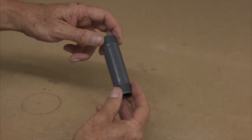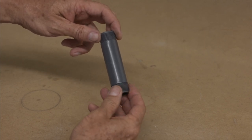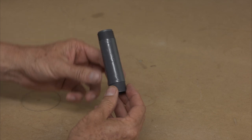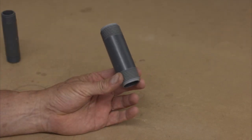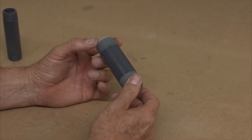On molded fittings and nipples, there can be variation in the overall thread size, which can lead to fittings being too tight in some valves and too loose in others. The cut threads in this nipple are much more accurate and provide a better chance at a leak-free installation.